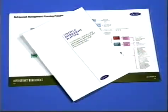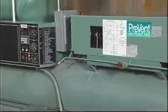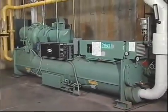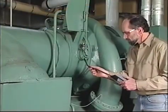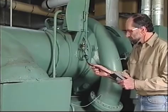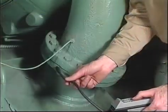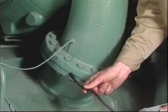The refrigerant plan will mainly address things like complying with regulations, proper record keeping, leak detection, and steps to reduce risk of accidental emissions. For those who have low-pressure CFC chillers, the waters are considerably muddier. A continued supply of refrigerant will depend on recycling and reclaiming, and will undoubtedly become increasingly costly. Leak detection and prevention are more difficult than with a high-pressure chiller, and the penalties for emissions of CFCs are more severe. Leak prevention becomes extremely important, not only because of environmental considerations, but because of limited availability of replacement refrigerant.